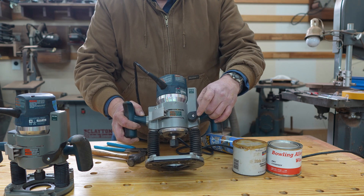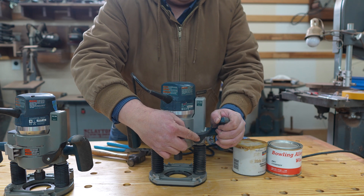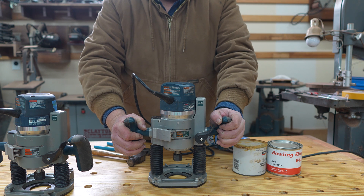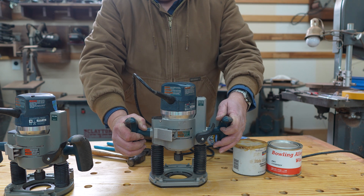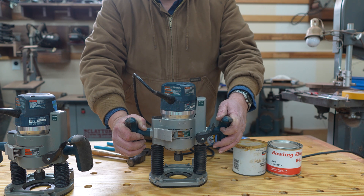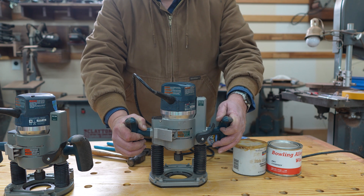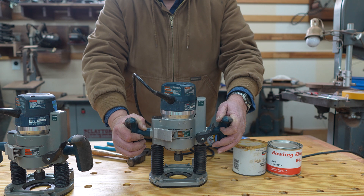The locking mechanism is essentially right behind this screw over here from what I can tell. I'll apply a little bit of lubricant and see what happens. I'm going to start out with some paste wax because that seems easiest to reverse — if it causes more problems than it's worth, I'll take it off and try something else. One other person had recommended using rubbing alcohol or denatured alcohol to try to clean things. I have some extremely strong denatured alcohol, so I may try that and see if cleaning helps. Then I'll bring the camera back again with another update.